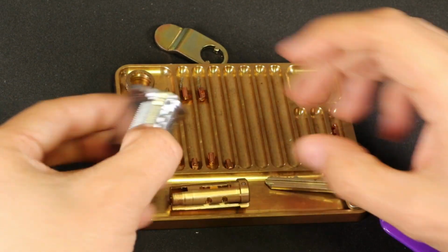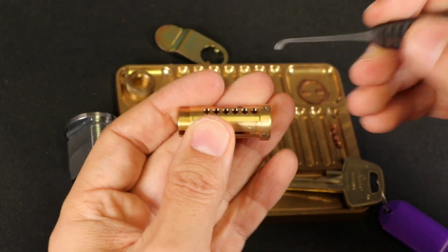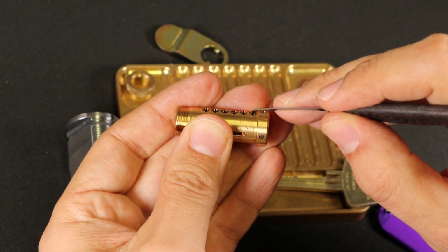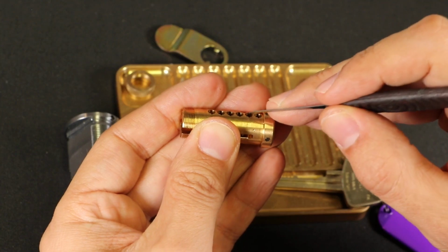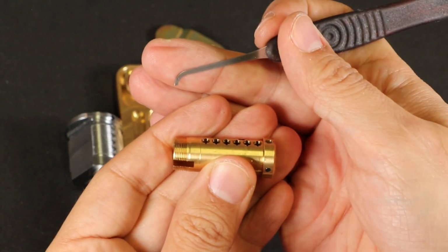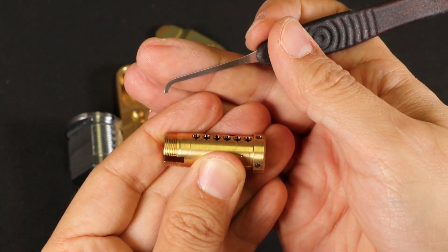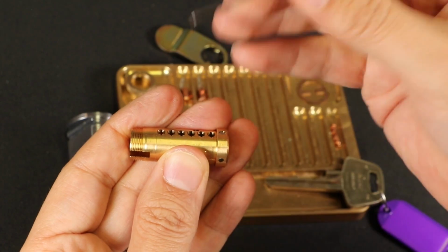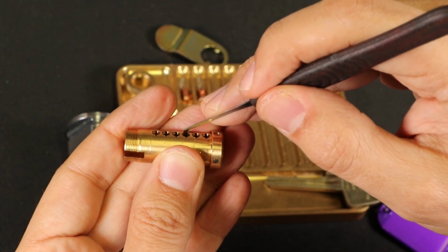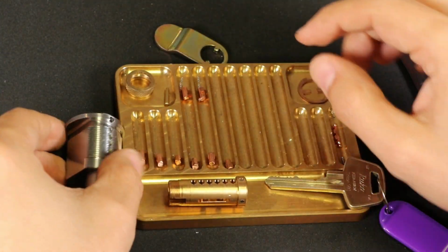All right, and then these have just springs, whatever. Driver pins. Oh, before we get to driver pins, on the barrel, there will be counter milling. There're going to be 2 light counter mills like that. 1, 2. And those light ones will catch the thin lips on the barrel spools. If it were gin spools, like on some of the older locks, it'd be one wide serration that would catch the thick lip of the gin.